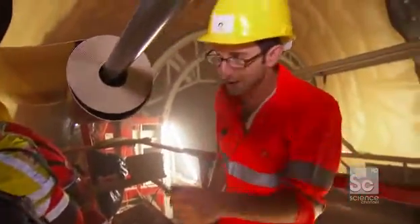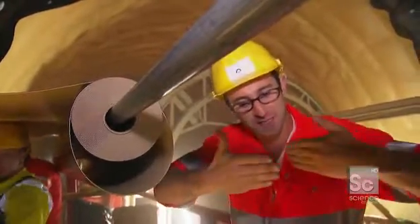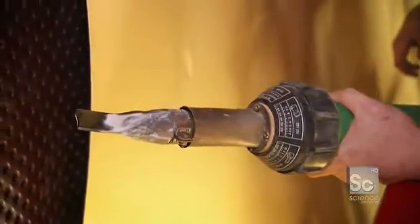What Philip's doing right now is taking a heat torch, putting it on the back of the plastic and melting just a little bit — so there's no tape, there's no nails. He's literally melting the two pieces to form one solid bond. The heat gun, called a hot air welder, melts the plastic at 600 degrees.